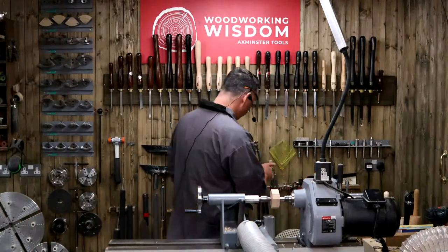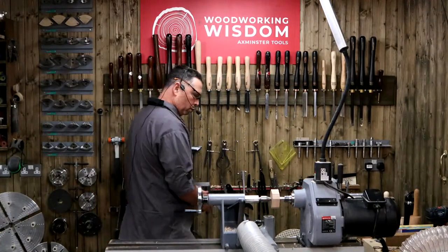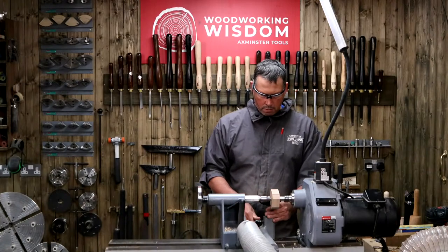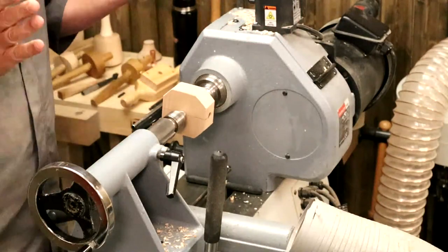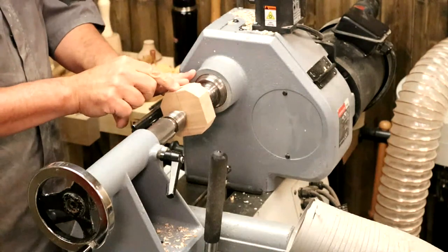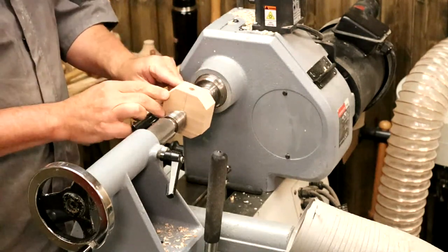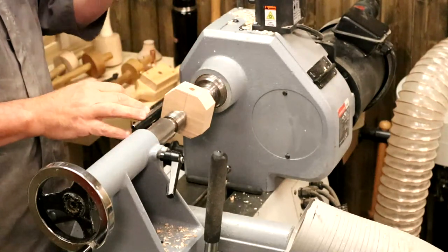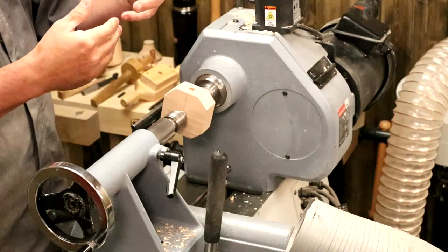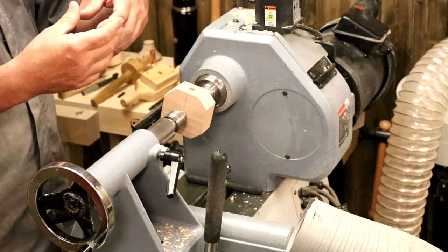Okay, so let's go for some turning. Let's get my small tool rest in there. We'll pick up a few more questions in a second. Let's get a little bit of turning done first. So I've got center point. I've got my hole drilled and now tapped as well. So that's all good. I'm going to roughly turn this to a cylinder, then hold it in a set of jaws so I can drill the center out ready for the main arm.